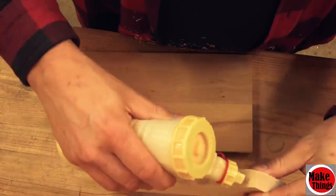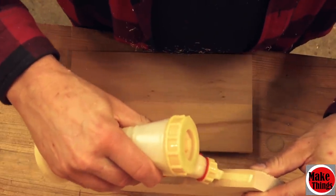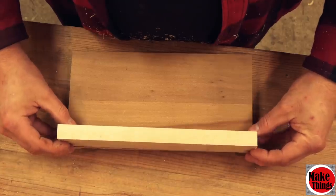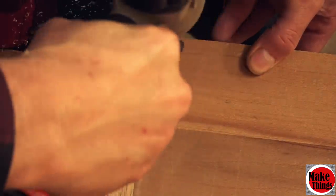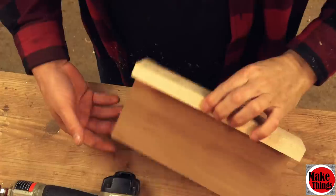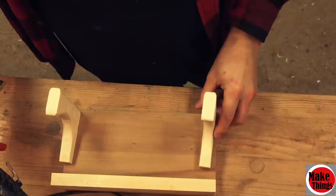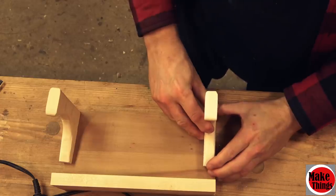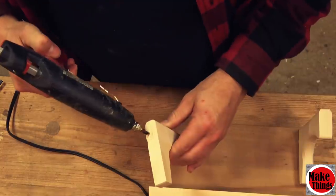Due to the fact that we'll be ripping this jig down the middle, we'll need to attach a fence to the front. This fence will also later be used for the double dowel clamp, so it's important that it's straight and 90 degrees from the sled base. A couple of brads and I let it dry. Because I'm going to apply screws, I didn't want the handles to move around on me, so I used hot glue to hold them in place.